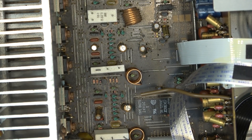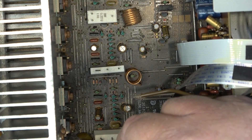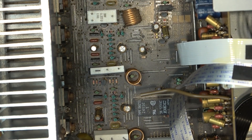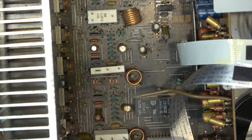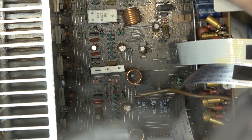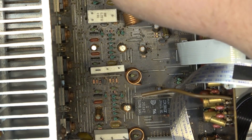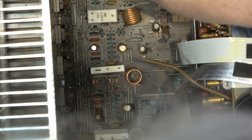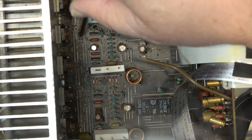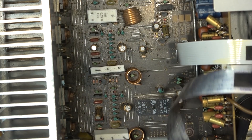There's a good likelihood that there are transistors that are blown on this one. I believe he just uses it for music, so in the event that there are outputs that are failing, we may be able to get away with just disconnecting the blown outputs. I don't know how far the owner wants to go with it — he didn't indicate that he wanted to spend a lot of money. He just wanted me to look at it and give an idea. He put it outside because he's got a new system in the house, figured it would be good to have out by the barbecue. Putting electronics outside generally isn't a great idea with all the moisture we have here — you're asking for trouble.